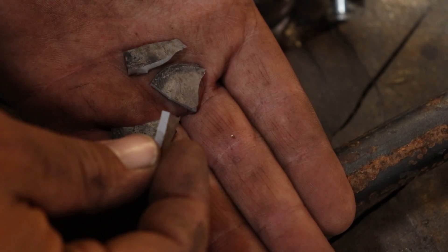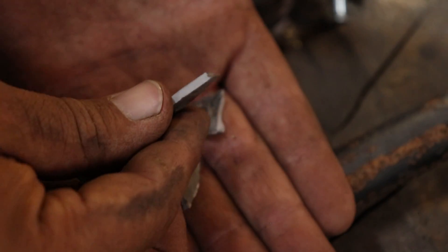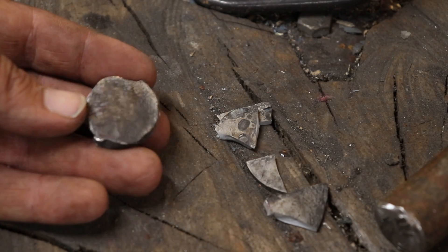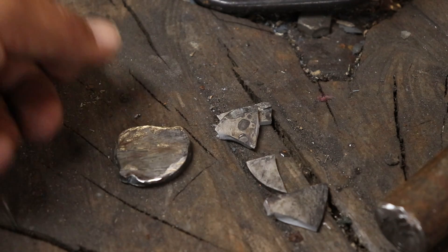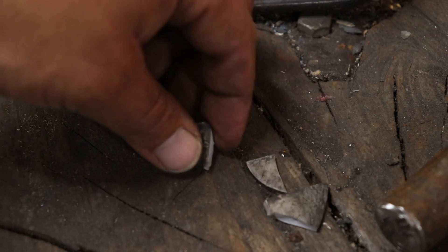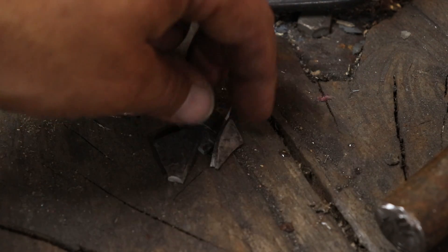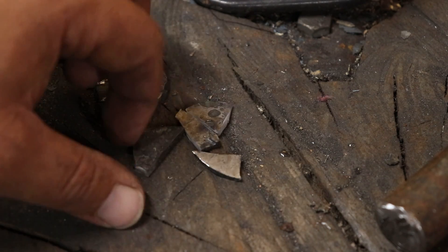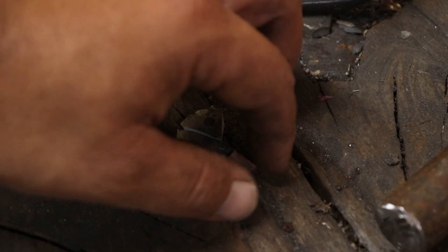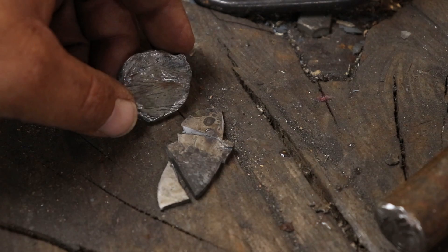But it does show me that that steel is getting very hard, which is what I want. So the first round of testing: the regular piece of rebar is very resilient, and the big piece — the inch and five-eighths — became brittle in the water, so I know that it is hardening up. I'm going to do the next piece in oil, just for fun, to see what happens.